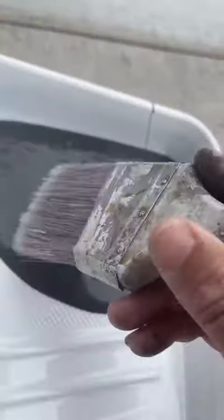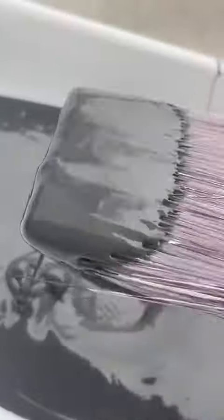The homeowner provided the paint, but unfortunately after a few months, especially on the exterior, it's not going to match. The sun, the weather — it just kind of fades out the paint. And even if it's the same exact paint, it's not going to match 100%. So I'm just going to paint the right side corner to corner — that way there's not going to be any paint difference.